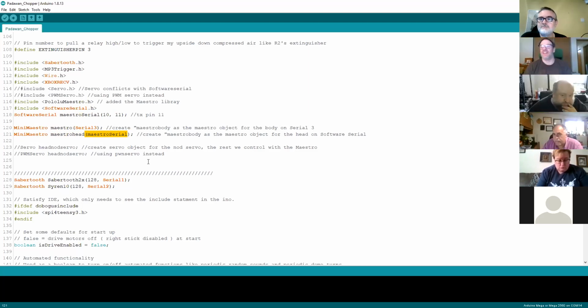Yeah. So part of the problem is all these serial ports taking up all this overhead, right? Has anybody thought about having your main thing with your Padawan system, and then maybe another Arduino that can act as a serial port hub, so to speak? So you just use one port out of the main system, and then assign a device ID to tell the next one what you want to address and send.